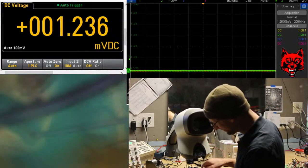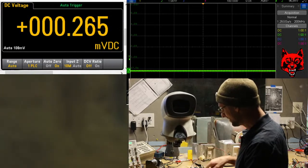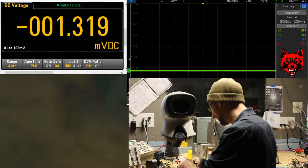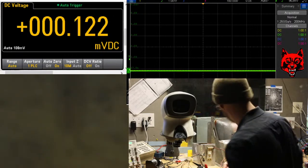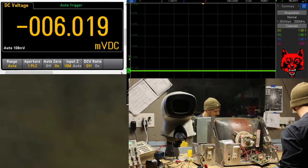Visually, I can see some burnt resistors here. The values are good. They're under here. You can't see them. The values are in tolerance. One is drifted pretty bad. They took some damage here. This is probably open. Anyway, now I can put you to sleep because I'm going to start taking out stuff, tearing it out, replacing stuff.